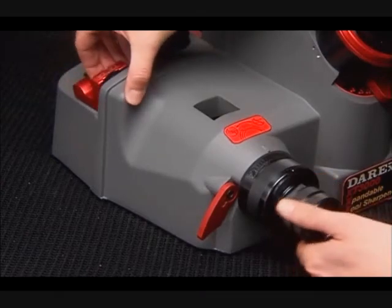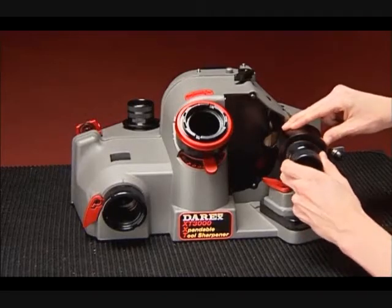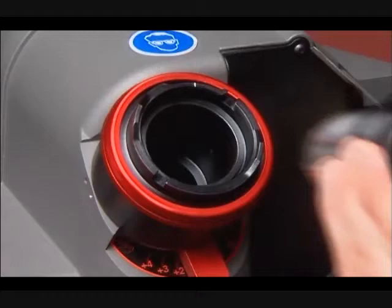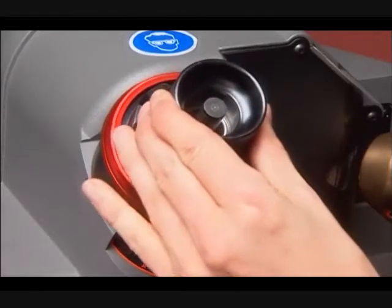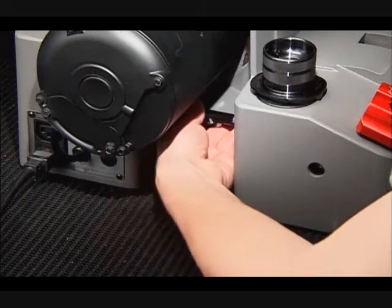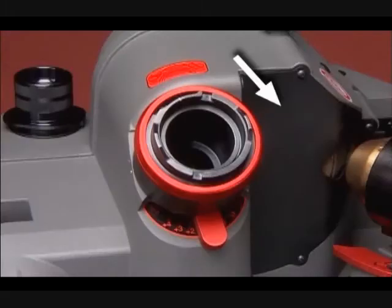When the alignment slide handle is pushed in, it closes the pawl arms. The sharpening port features the cam guide; note how the sharpening tube turns to insert the chuck. The splitting port contains the cam dogs for aligning the chuck. The grit tray collects dust particles from sharpening and splitting, and the cover is removed to replace the sharpening wheel.